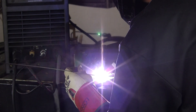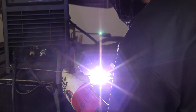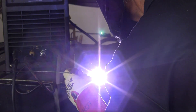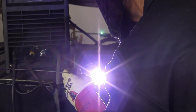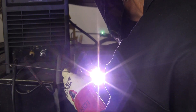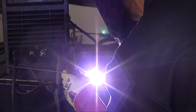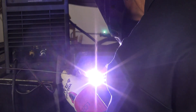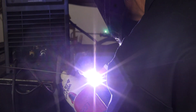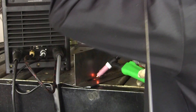That gives you that stack of dimes ripple effect on the bead, and you keep going in an even motion. It's critical for the material to be clean — you can't have any residue of any kind: no oil, no scale, no crap. I always wire brush it first. There are two arc start modes: lift start, where you actually touch the tungsten against the material and then lift to get the arc, and high frequency, where you just get close to the material, hit the button, and the arc comes on.